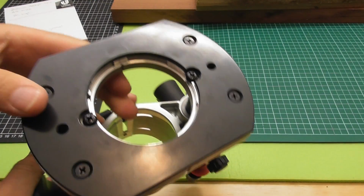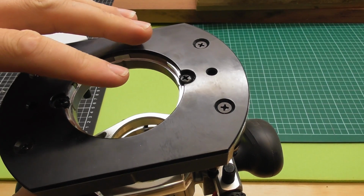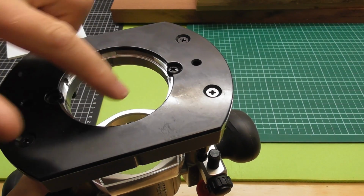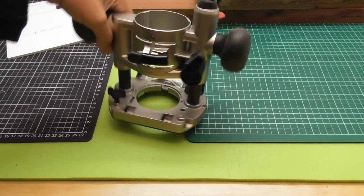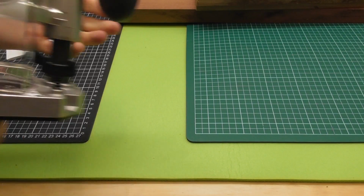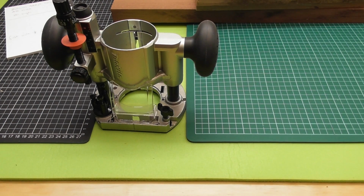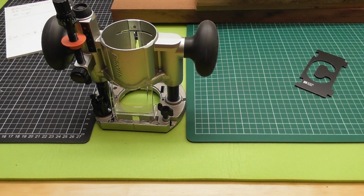So I'm going to make my own guide bushing plate. I'm going to remove this one, mark it out onto a piece of polycarb, and make a new plate that goes over the whole area with the right size hole drilled in the middle. But that'll be on the next video. This video is just an unboxing, to show you what you get. In the next one I will show you it functioning, hopefully with my new plate on it, and we'll router out some words, we'll make some signs.